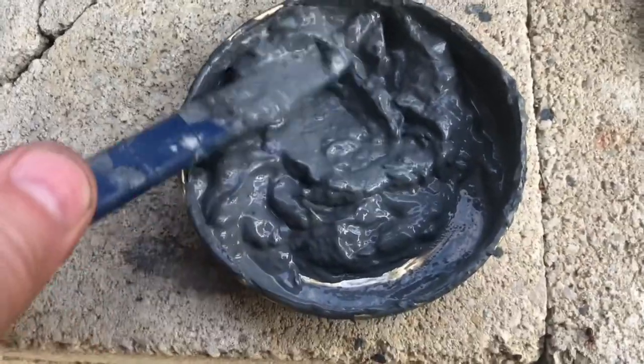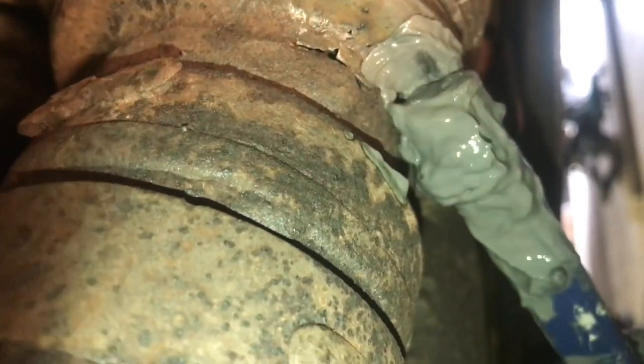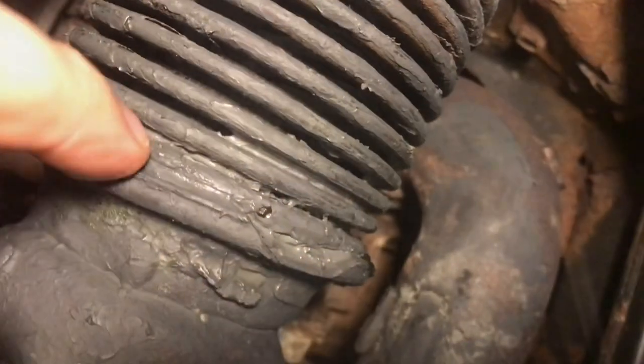After a little bit of time, this is all worked in and ready to go. Work the sodium silicate into the cracks and into every crevice with a glove. You don't want to get this stuff on your hands. Let it dry for about 12 hours.